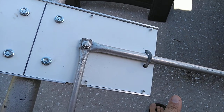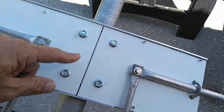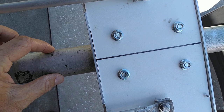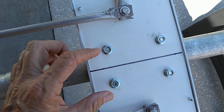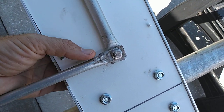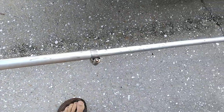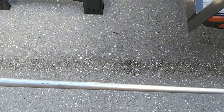I cut this at 18 inches long, six inches wide — that's just so I could find my center point. This is based on a two-inch boom; you could do it with a three-inch as well. The u-bolts hold it to the boom, and this bolt goes through my elements. I'm using Mako elements so they are adjustable — the centerpiece is five-eighths, the outside is three-eighths.